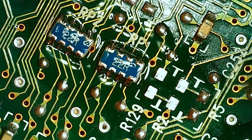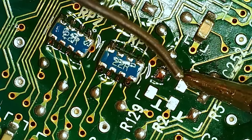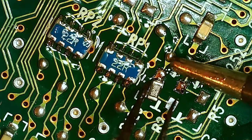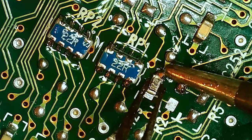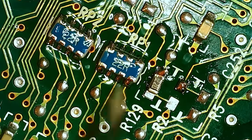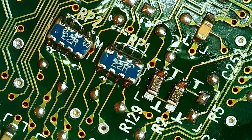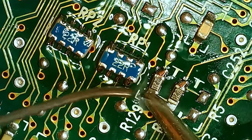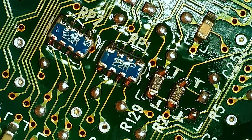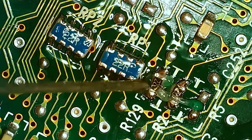I took two resistors off the donor Voodoo 2 here. So yeah, I could do this with hot air, it would be nicer, but I think I'll do it with the soldering iron, because I expect people to do it like that more than with hot air. You can always tidy it up with hot air afterwards if I'd like to, just to make it look better, more straight, things will flow in place then, and sit flush and so on.